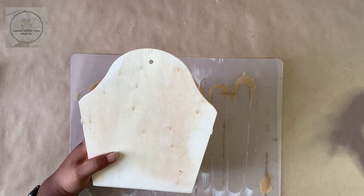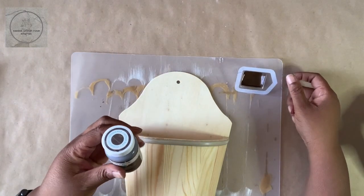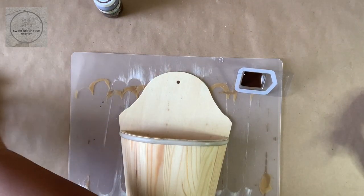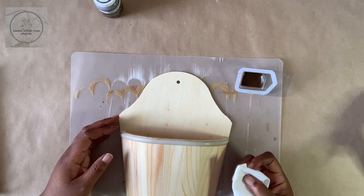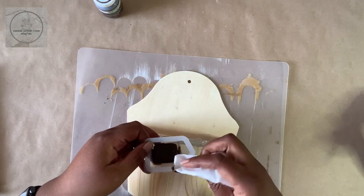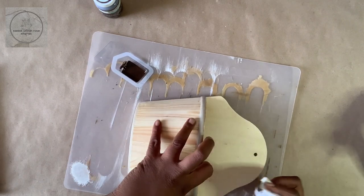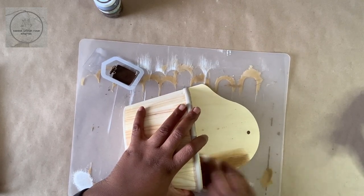To begin, I'm going to take this Waverly Antique Wax and use the baby wipe method to apply it because I don't want a fully dark color — I just want the lighter version on there. So I'm going to go ahead and cover the whole thing. I did sand this before I got started, so I'm going to do the whole thing — front, top — and get as far down into the inside as I can.